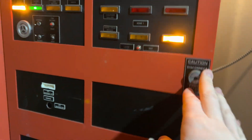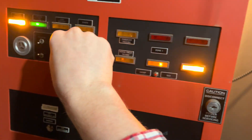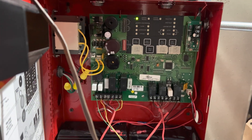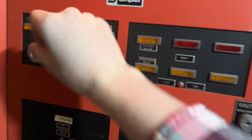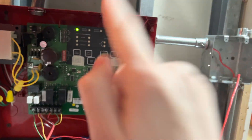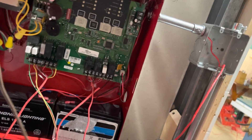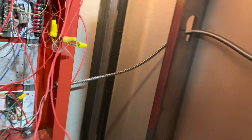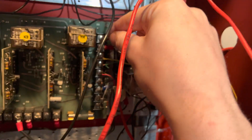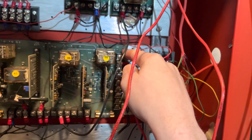To take care of troubles, what you can either do is hold down the alarm reset on this, or you could reset the panel on this. That is because this relay right here is connected to the remote reset contacts on this.